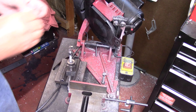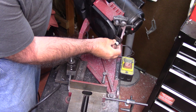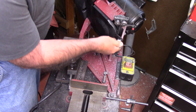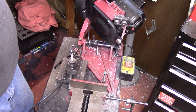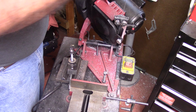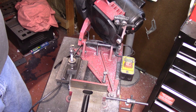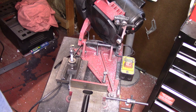One of the things — I don't know if I've showed this or not — is these little thumb screws I made a long time ago. When I first got my saw, most of these saws have Phillips screws in them. So changing the blade always meant hunting a tool. The first thing I did was drilled and tapped all these out to standard and used quarter-inch 20 set screws and made these thumb screws, and that's been handy, handy, handy.